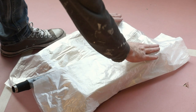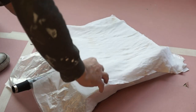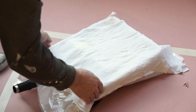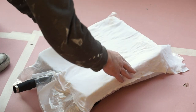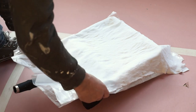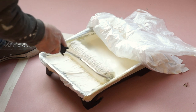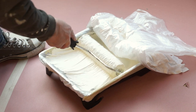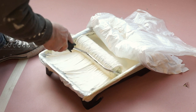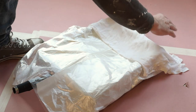And here's the key: take a rag that's larger than the pan, run it under water, wring it out, and lay it over the top of the plastic. What you've done is created a kind of seal, and the moisture in the rag will help keep the paint wet. About every 15 to 30 minutes, come back and lift the plastic and the rag back up and re-roll the paint onto the roller pad. You just want to make sure this stuff doesn't dry up on you, because if it dries up you're going to have little chunks of paint in your wall. So make sure you keep it nice and wet and come back and check on it every 15 to 30 minutes.